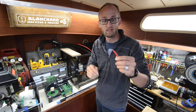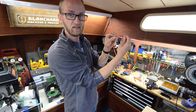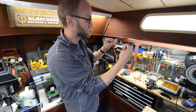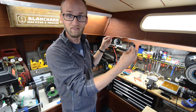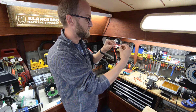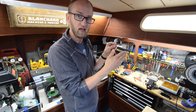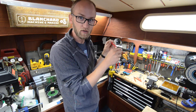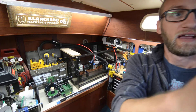What I did, in a nutshell, is basically heated up this extrusion at one end while the far end was clamped in the vice on the workbench. As it heated up I just pulled tension and stretched the whole thing out until it got really long — like a piece of Laffy Taffy or gum. I held it there as it cooled, and since I stretched it from its original position it kept the tubular shape. Once it was hard I could just snip it in the middle of the elongated section, and I had a nice long tapered tip tuned for laminar flow to use here.